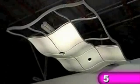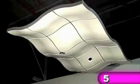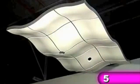After all topo panels surrounding utility circles have been installed, install the remaining panels as indicated on the 2D drawing. Topo panels all have the same shape. During installation, each panel can simply be rotated until properly oriented with the vaults and valleys of the topo grid. If your installation includes topo panels with preformed utility circles, note their locations on the 2D drawing and install these accordingly.